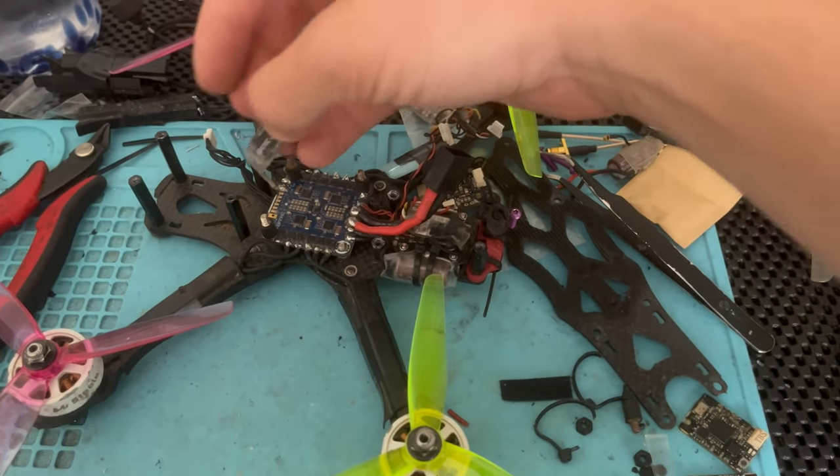That's going to do it for this video. I hope you found it helpful — I think it's pretty easy to install a capacitor. The convenience and durability of doing it this way is well worth it. I can fix it, replace it, store it wherever I want. If you direct solder to the board, you risk it breaking off in a crash, and if you fly like me and crash a lot, doing it this way is a lot more convenient. I haven't had a problem yet.